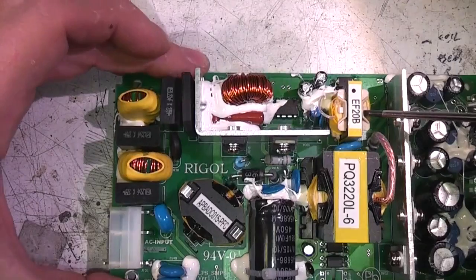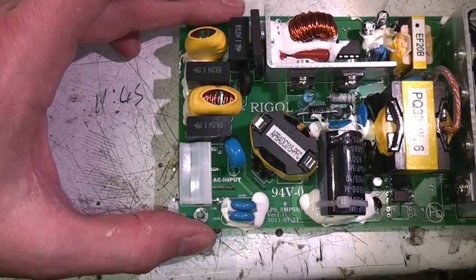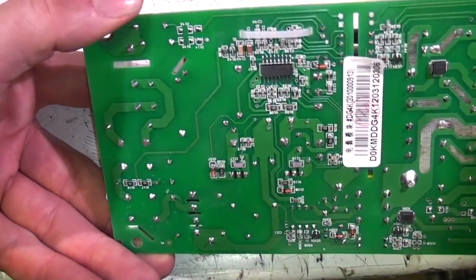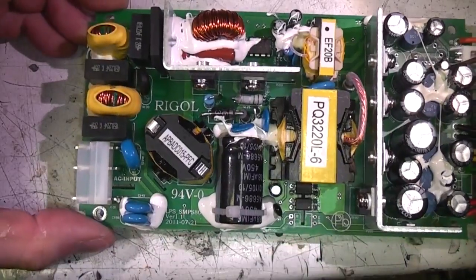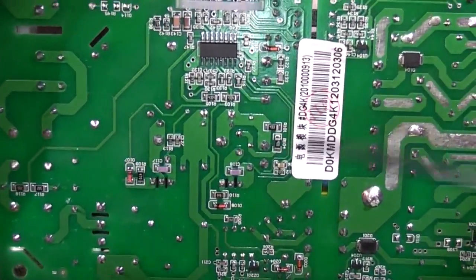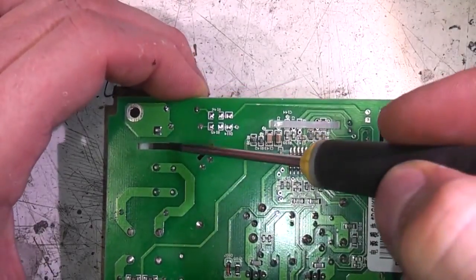Pretty up-to-date modern design here. There's a standby supply using a chip designed for things like phone chargers to provide very low standby power — because this doesn't have a proper mains on/off switch, it's got a soft on/off switch, and they've gone to some care to make sure it doesn't draw too much in standby. Both power supply control chips are from NXP. Again there's a distinct lack of any Chinese components — the output rectifiers are On Semiconductor, the electrolytics are EPCOS. It's almost like they're deliberately avoiding Chinese parts even for relatively routine components. The layout looks nice, with star ground detail and slots and cuts to improve creepage distances.